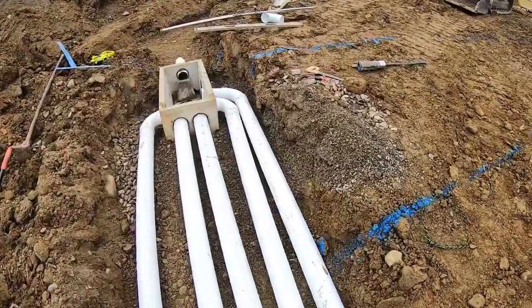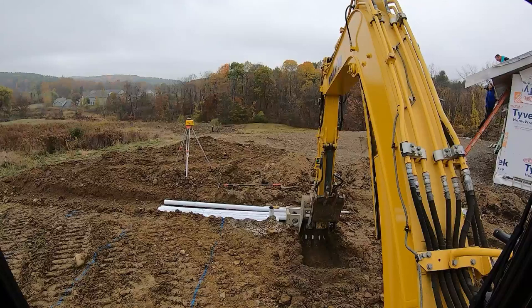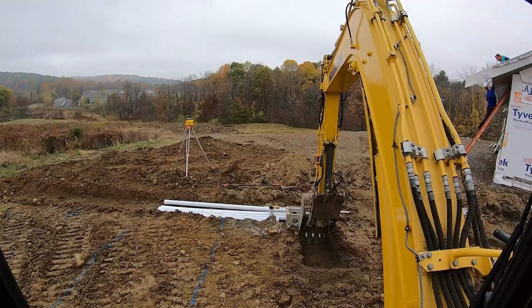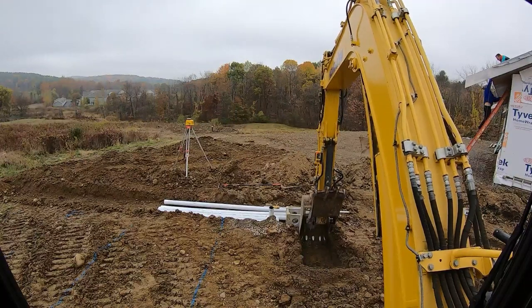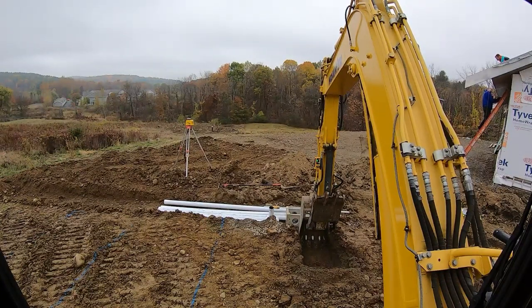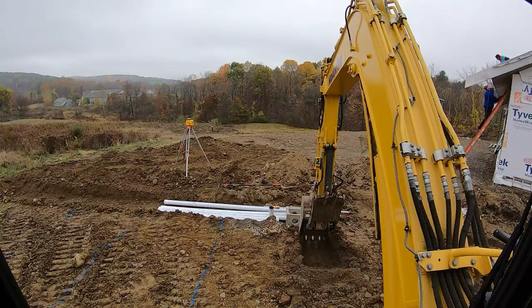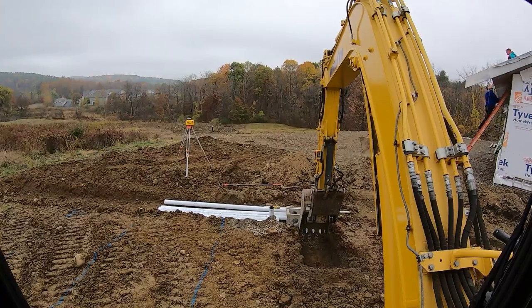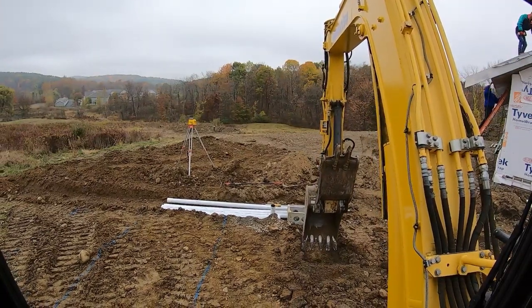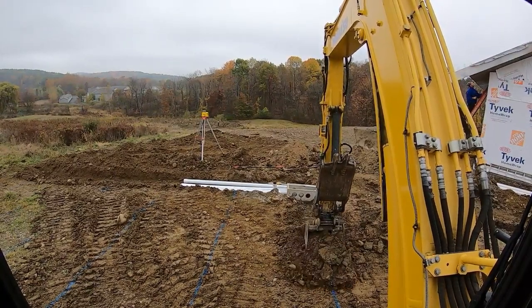So now I'll just take these two pipes off here on the closest end and start excavating one at a time. All right, laser's on the stick, green light is good. A lot of discrepancy I've seen the last month or so, people doing videos of this. You want to leave your bucket open completely all the way, so there's no room of air. If your bucket's all the way open, then you know it's all the way open. Leave your stick at a 90, that's great, done deal. If your bucket is flat and you curl your teeth a little bit or open them a little bit and you can't tell from the cab, you're inches off. So if your bucket's completely open where it's locked open, it takes all the guessing out of it. All right, and that's that. Stay with the line and dig.